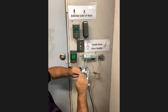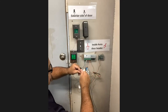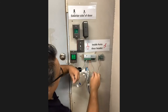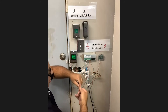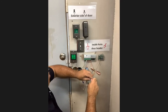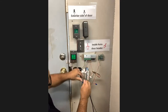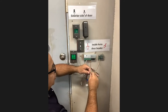The other leg of R3 is now going to go directly to power. I need to go directly to the positive leg of power on my BR3X and on my receiver, the RD900. Now I have everything powered up properly. I also have the negative leg of my BR3X going to the negative leg of the power supply, and the negative leg of my receiver going to the negative leg of my power. That completes our wiring.